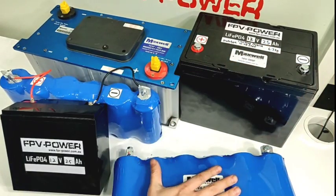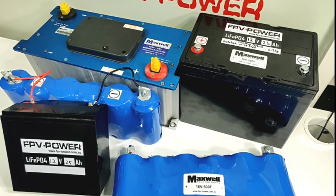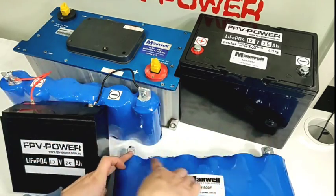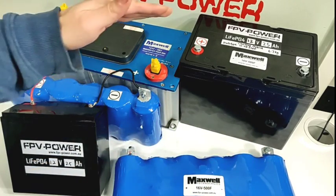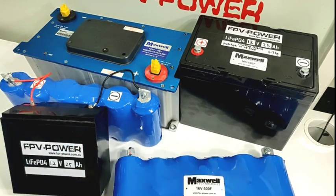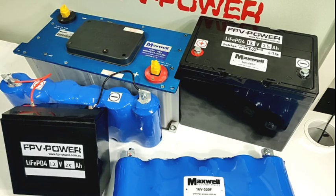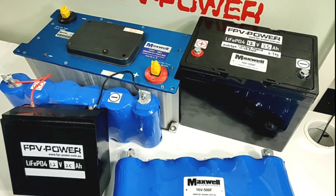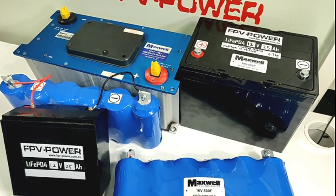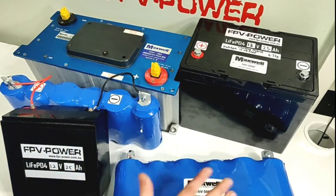Even though some people are doing it where the car is parked outside, not undercover. They've got a little, maybe 5 or 10 watt solar panel, which is the size of maybe this big. They throw it in front of the dashboard under the sun, and they just keep it connected to the supercapacitors directly. And guess what? Every single day, whether it's cloudy or not cloudy, bang, the solar panel keeps these charged at all times. So that's one instance where people can get away with doing this, knowing that they've already got a system in place to keep these charged all the time.